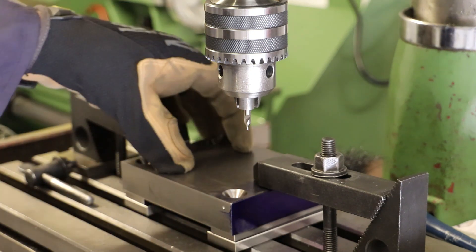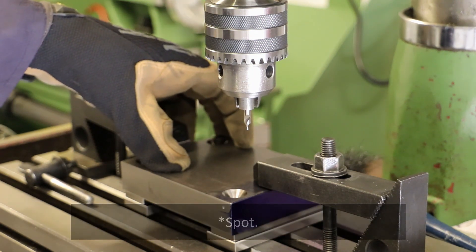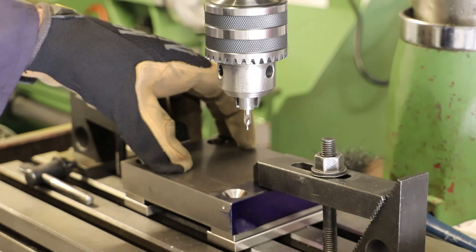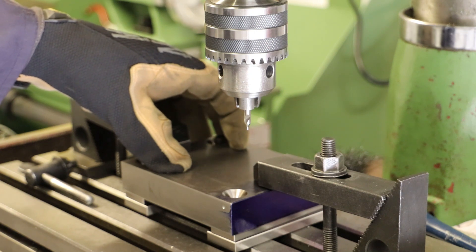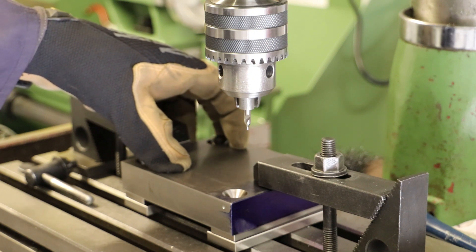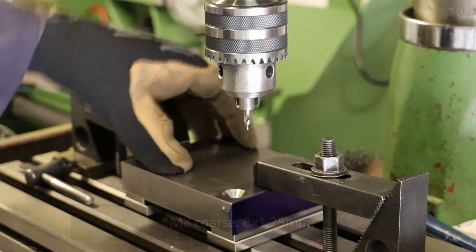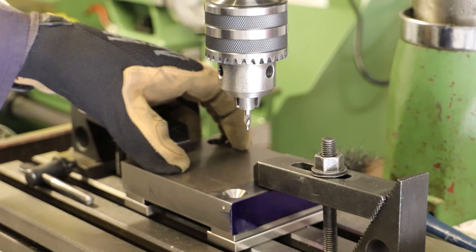What I'm now going to do is centre tap the two holes to secure the back end of the top plate of the tool post. They will be drilled and tapped for 8mm thread, 8×1.0mm. I'll use the centre drill to mark out the points for the two rear holes which will then be drilled out and tapped at M8.